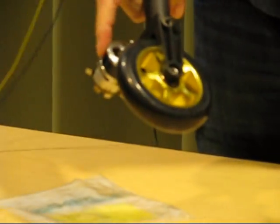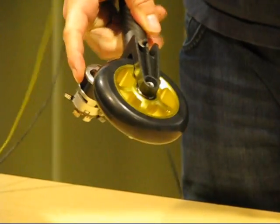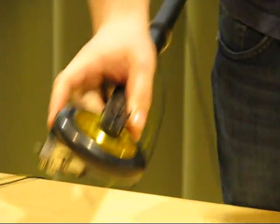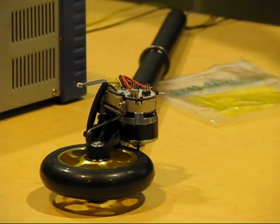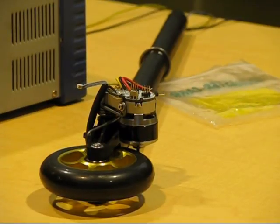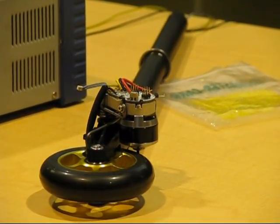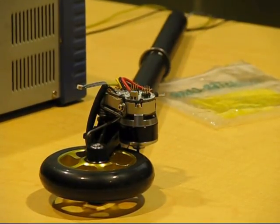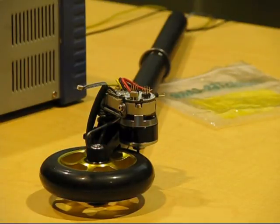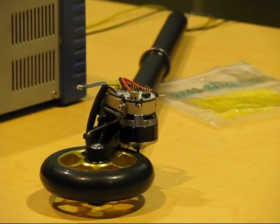And I will let you all come up and feel this later. It's a lot more impressive if you can feel it. It's a rather smooth torque ripple. If you've ever ridden an electric bike at low speeds, at least the ones that I've tried with three-phase motors using that square wave, you can feel as it starts up, it goes, as those square waves are going by. It's as though you're a crank, you're always pushing the same phase, or the same torque, or same force, regardless of the angles. You're not getting that beautiful sine wave motion.